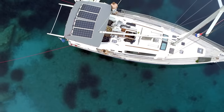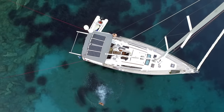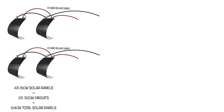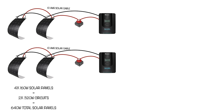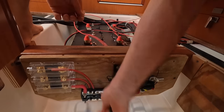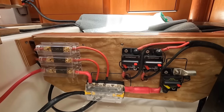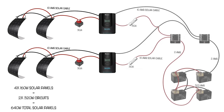Now let's talk about solar panels. I have four 160 watt Renogy solar panels, now coming up to four years old. I connected them in pairs in parallel — positive and negatives connected together — and used 6mm solar power cable with a thick durable cover to run them back to the charge controllers. For the cable length I have, this gives a maximum of 30 amps of current I can safely run, so I use 30 amp isolation switches between the panels and the charge controllers. From there I connect them through a large distribution block with 30 amp fuses to the lithium batteries. I installed them this way because I only want my solar panels charging my lithium house batteries.